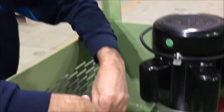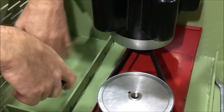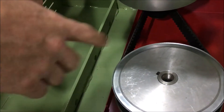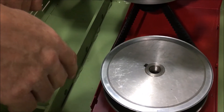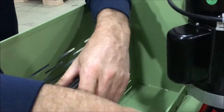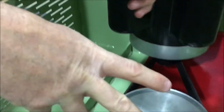I'm going to show you a little bit more about our new rotary flat laps. I'm currently looking at one that I have inverted right now — we're putting the pulley system in. We went to a timing-style pulley because of some advantages. If you look at the old laps, they have these huge 12- or 14-inch pulleys because the minimum size for a V-belt pulley is typically an inch and a half or two inches. But with a timing belt you can get a much smaller drive pulley and achieve the same ratio using a much smaller space.